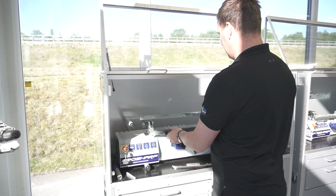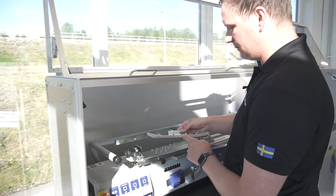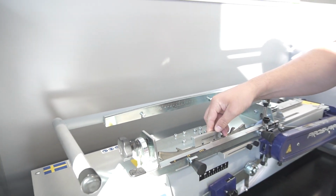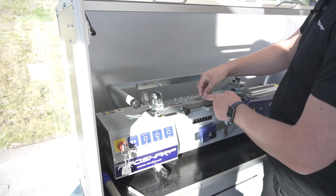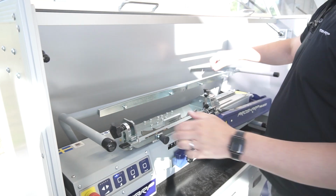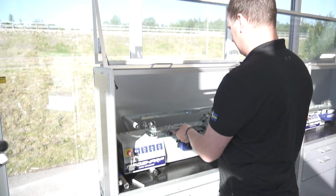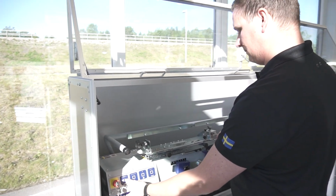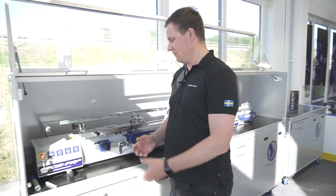We remove this template. We put the 20 millimeter mark on the pivot point. What we do then is that we hold the blade and move the sledge until we have the pivot point on the center mark of the blade. Then we clamp it. Then we take our quad 0, for example. And then we do the profiling as before.